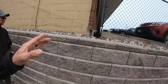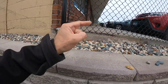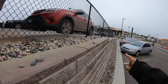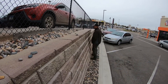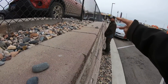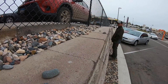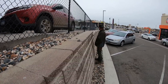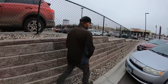The building could have footings deep enough to not impact a surcharge on this wall, but the sidewalk does not, and the asphalt does not. You see that car above the wall? This is a five-foot wall with a surcharge on it — it should have two, possibly three layers of grid, each layer four to five feet back. They did not put that in, because you can tell the parking lot hasn't been altered. Too many indicators on this wall say that corners were cut, even though the wall looks good.